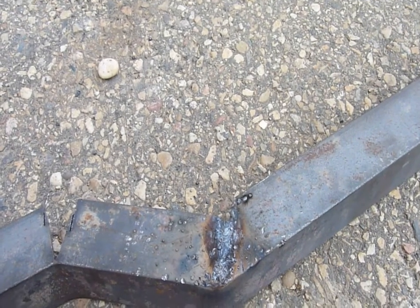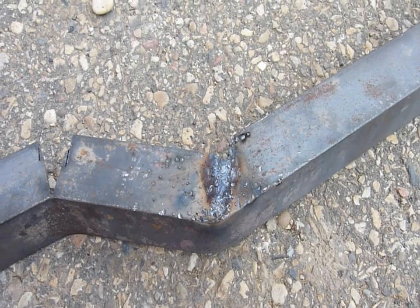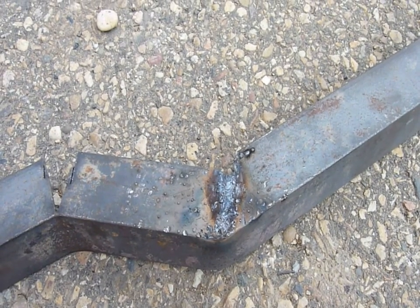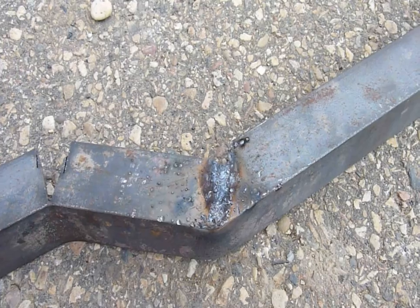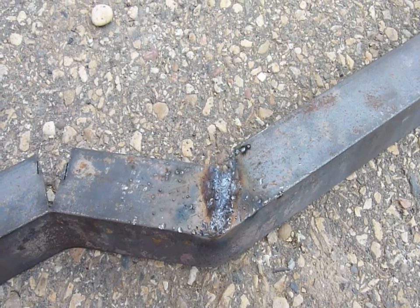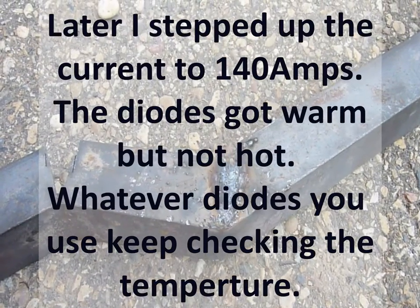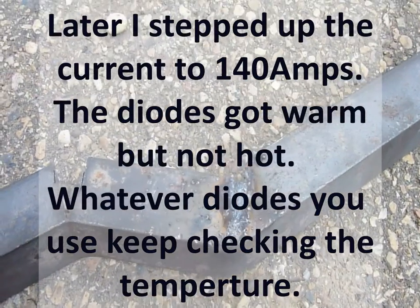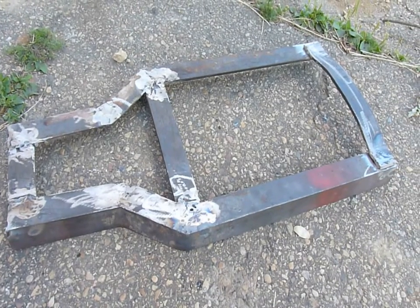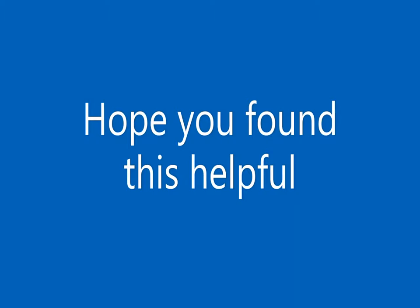Hopefully you found that helpful and encouraging. I would try to keep the diodes down around 300 amps so you get a better peak reverse voltage protection. Other than that, I think it's going to be fine. When diodes get hot they tend to short, and that's the last thing you want.